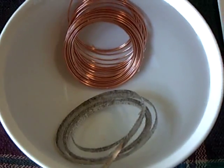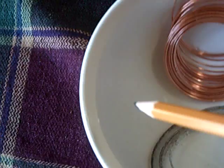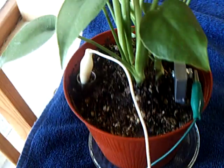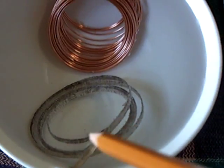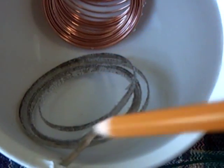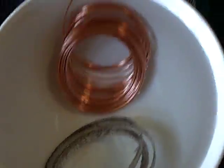What she's doing, which is what I'm trying to demonstrate here, is you put a lot more surface area in the electrolyte. This is just tap water — there's no soil on this; I'd have to put this in the plant to really replicate it. But she was getting 3 milliamps at 1.5 volts out of her latest plant battery, so I'm simulating that here. It's a whole string of magnesium ribbon and a coil of copper wire in an electrolyte.